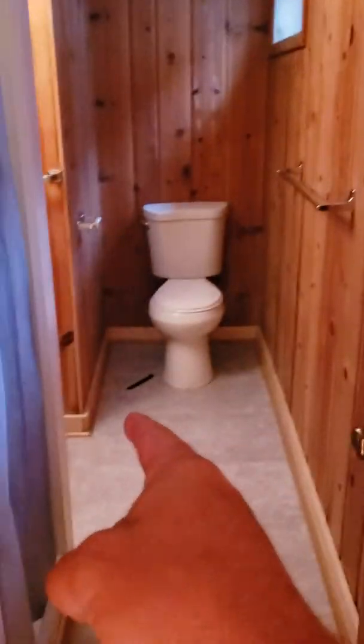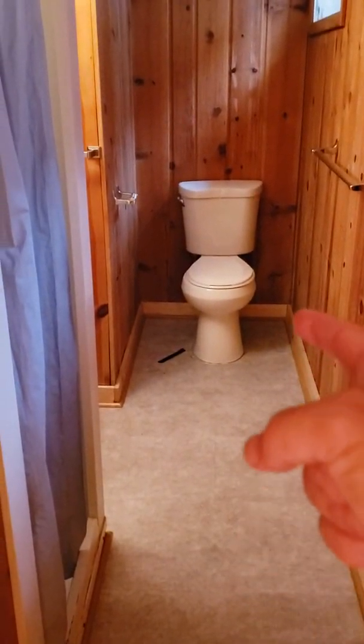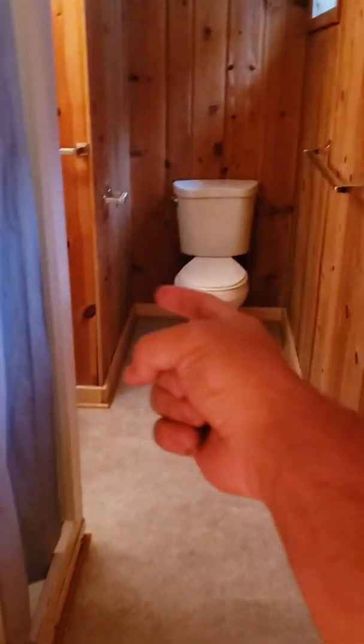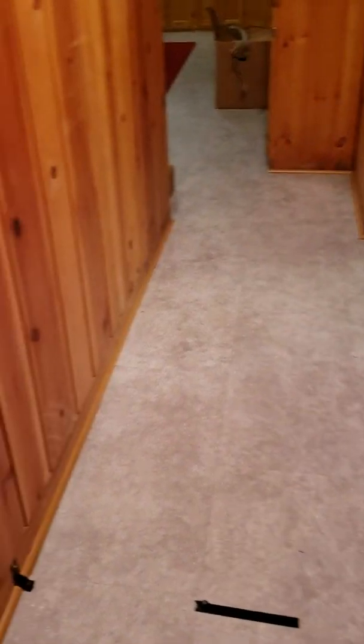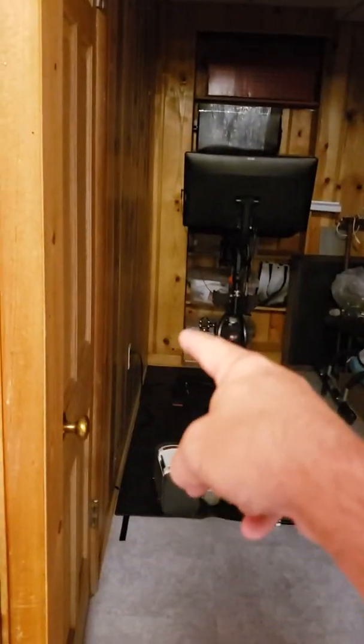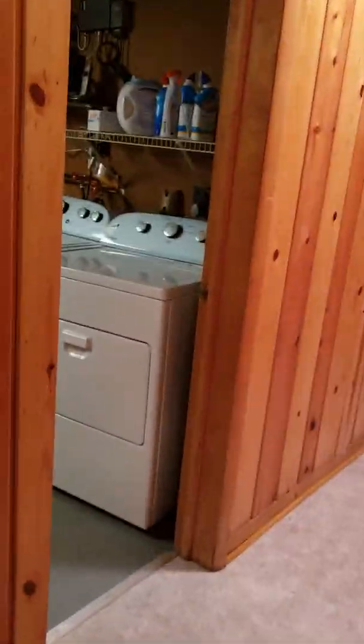Back here at the toilet, right past the toilet flange, down in the 90 right there — that piece of tape — the pipe is 100% full of roots. It runs full of roots, runs underneath there and comes underneath the vanity that's right in there, the shower, the closet. It comes to here — all roots and debris and all types of things — comes through here, turns and goes back that way. All full of roots, all full of everything. Nothing is really going to drain very well. So we need to go all the way back to that stack in there, bring it straight through here, get this pipe coming this way, go into the bathroom, redo the bathroom group.